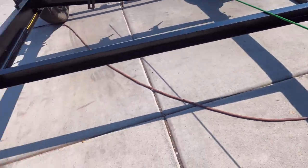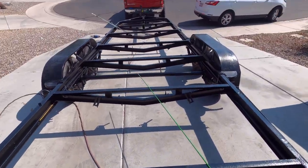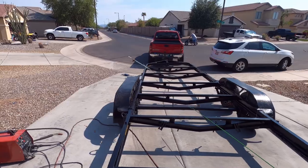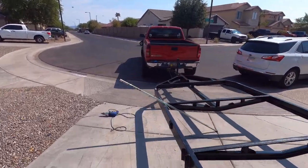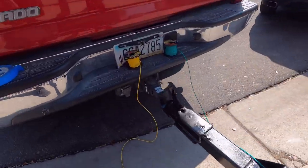We're using our green wire and our yellow wire — these are gonna be our blinker lights and our brake lights. We're using this long rod, just jabbing it in the hole and running it all the way through. You can see up here where it's teed off — it's gonna run through the center part of the trailer right up here and into the plug.